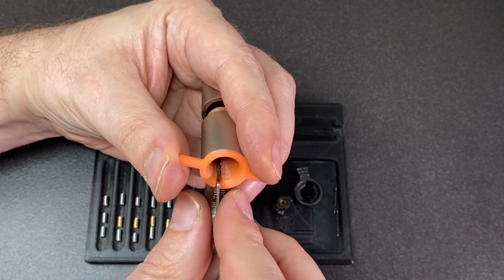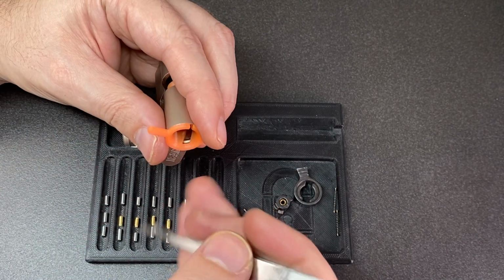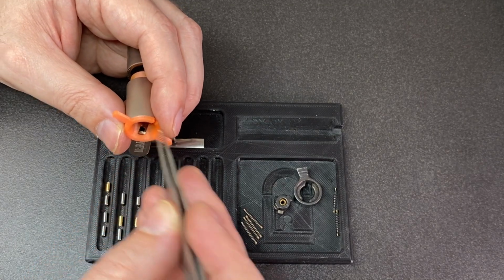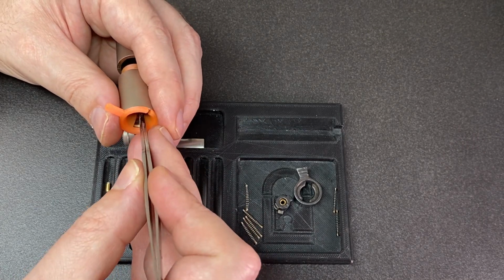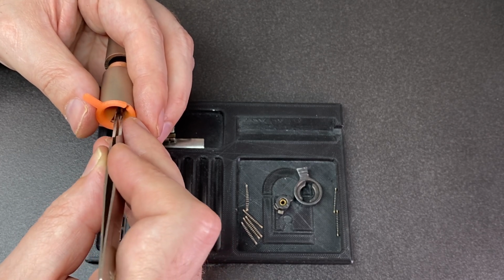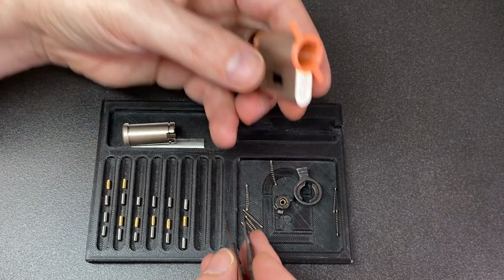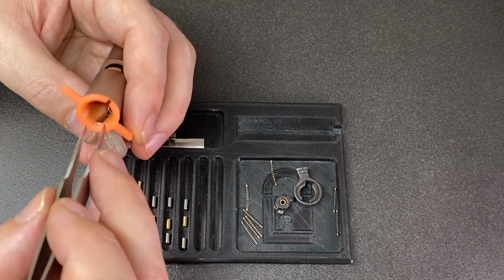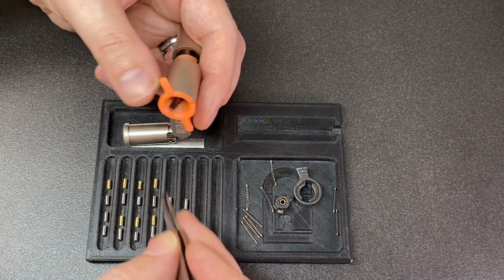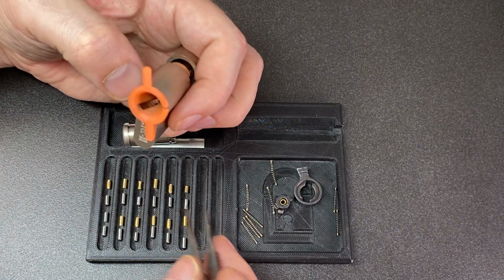And we'll go around this way again, starting on pin one, so take that out. We'll try it in a slightly more controlled way. So it looks like everything that pin is actually a, so that's a T-pin, that one's standard. So maybe it's modified as in the pin positions have been swapped around. In which case, I'll probably put them back the way they were. Then T-pin. More springy bits. Springs haven't been modded. Then standard. Then T-pin. Then that was the last one, which is standard.